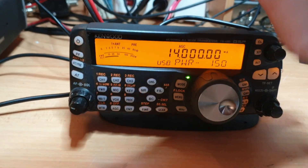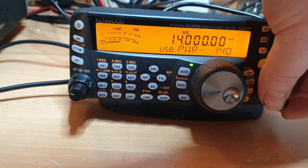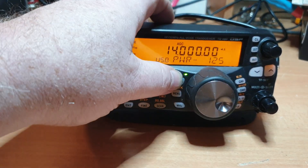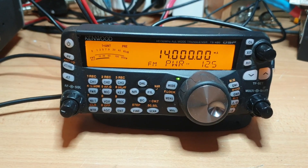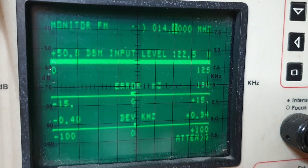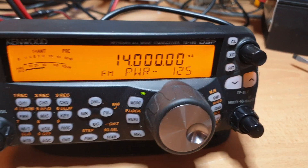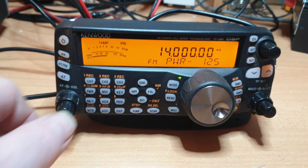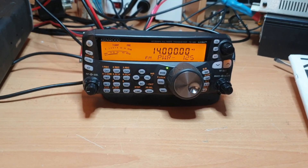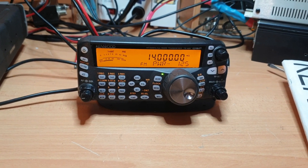My meter's having trouble tracing sideband, which is not unusual. Before I go back to FM, 125 watts is the max you should ever put through one of these monitors — it'll stop at 124.9. So 122.6 watts there at the 125 setting. The PEP on the sideband with a proper PEP meter would read a lot better, but it's certainly getting lots of power out.